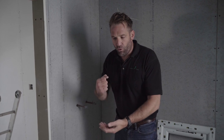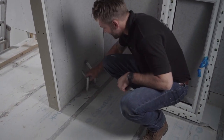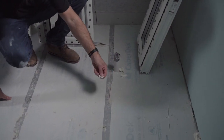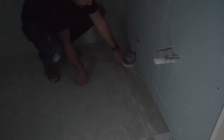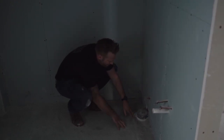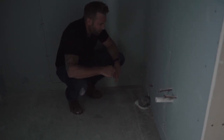The next area to look at is wet rooms — anywhere with water or electric coming in. The main problems tend to be in wet rooms. This looks like a main bathroom, so anything coming through the floor or ceiling needs a seal. We've got a bath going in with cold water feeds — make sure these are sealed in the floor to stop anything in the void coming through. We've got a waste pipe here that's been sealed. If you're using expanding foam, make sure it's a robust one and apply water first before spraying. Over here we've got a soil pipe — these tend to come up for toilets. People put boxing in and then we carry out an airtightness test and find all the air leaking through the floor void because these are roughly cut out, so seal them properly.